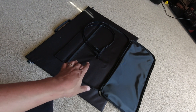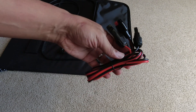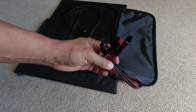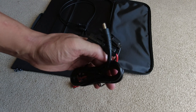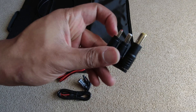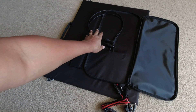You can plug whatever cable you need directly into MC4, so you don't have to worry about adapters necessarily, but they do give you some options. The accessories are like the best part for me: MC4 to Anderson with a pretty good length to it, MC4 to 5521, and they even give you a few adapters — an 8mm, a 5525, and another one. This is a completely well-rounded panel for something that's kind of budget.